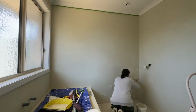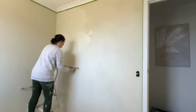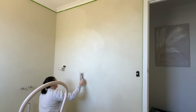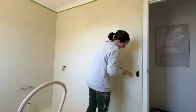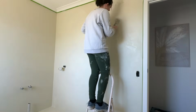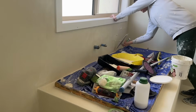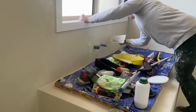So it's almost like silk or like a glassy kind of finish, as opposed to the base layer, which is a bit more sandy. So this is a bit more like plaster top coat, if you've ever worked with plaster top coat, whereas the base coat is that more sandy, grainy consistency. It's actually a little bit different than what I was expecting, because when I had micro cement in my mind, I assumed that the top layer was going to be more of that sandy consistency of the base layer, but it ended up being a lot smoother than I thought it was going to be, which is actually really good for certain reasons.